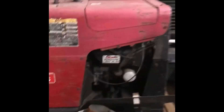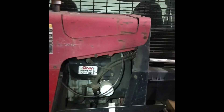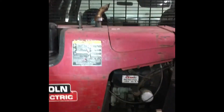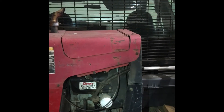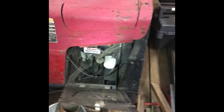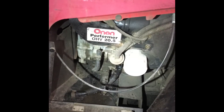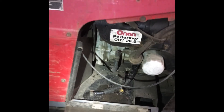It was able to pick fuel up again and now it's gravity feeding out of that crack. Chances are when I got here, this thing had already drained down past the level where it is now. You can see from the side that the fuel fill — where it was overflowing — is higher than where the fuel filter is next to the oil filter. So it's just gravity feeding down. That hose is shot, so it'll keep leaking until the fuel level gets below the point of the leak. After that, the fuel pump will just suck air through that rotten hose, won't catch prime, and won't give the engine any fuel. I'll get that changed up and we'll shoot a quick follow-up.